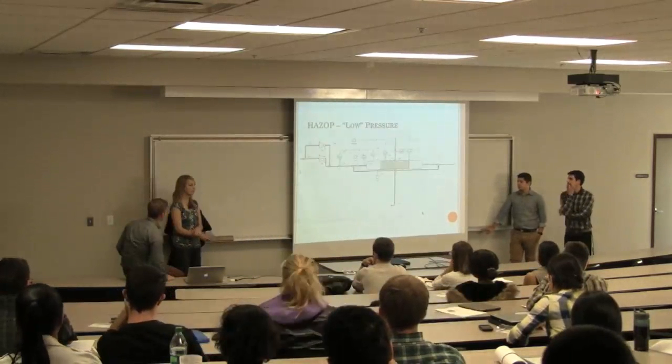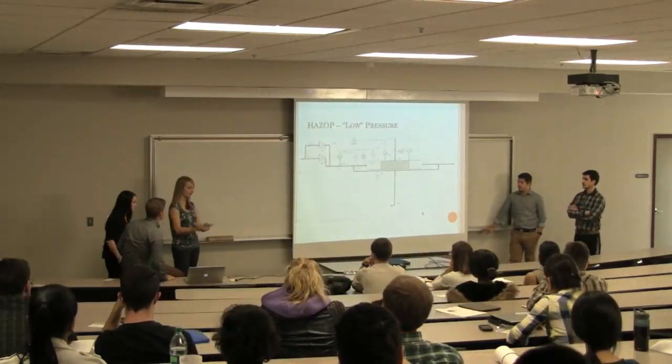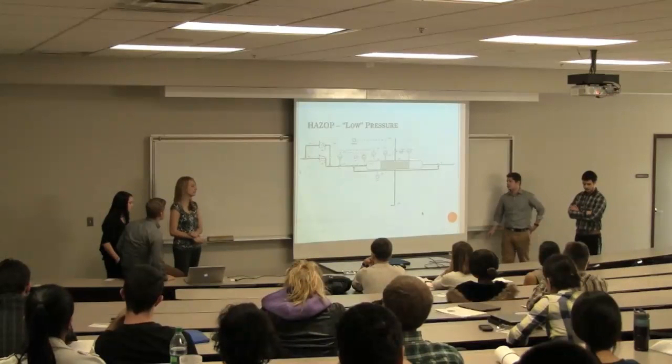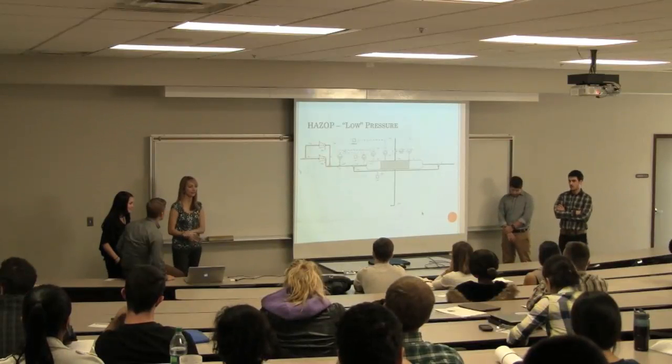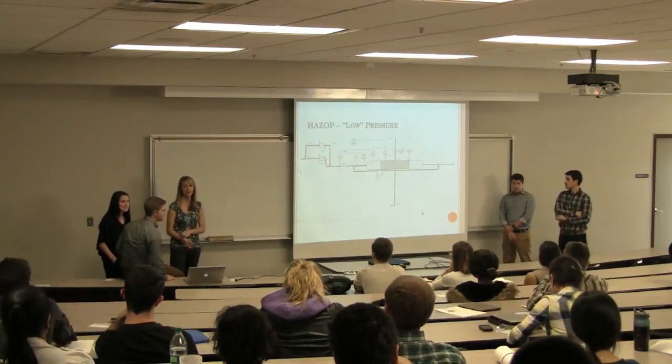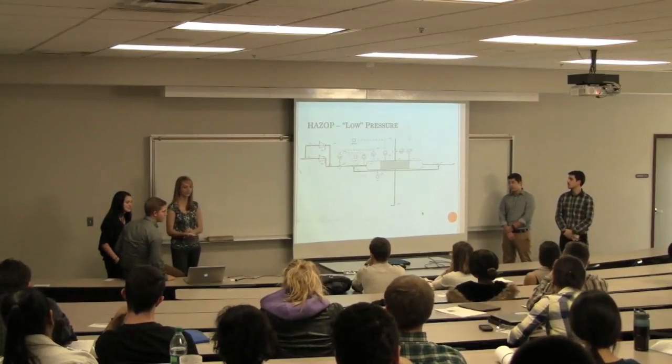So again, the guidelines are low and high, and I'm going to talk to you guys about pressure deviation. So first we have low pressure, and some causes of low pressure are failure in the pump, pipe leakages, and fouling. So these in turn can cause a pressure gradient to decrease in the system, and this will cause the flow of the system to decrease, and ultimately will decrease our yield.